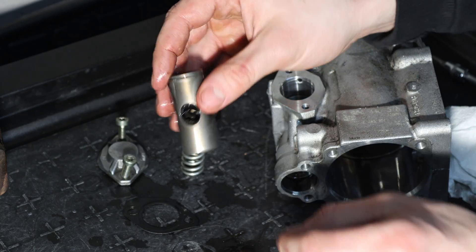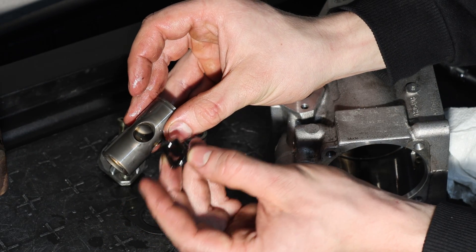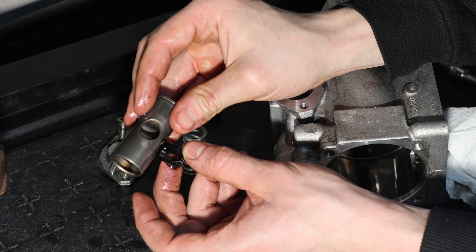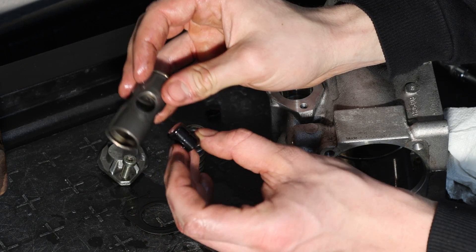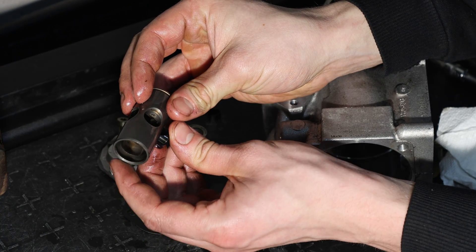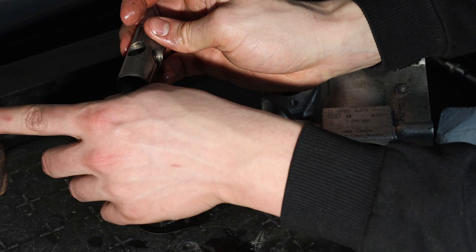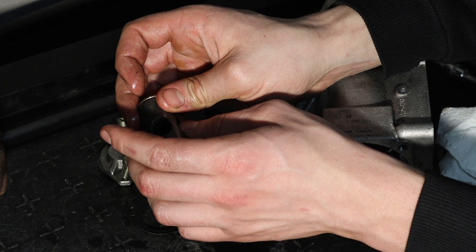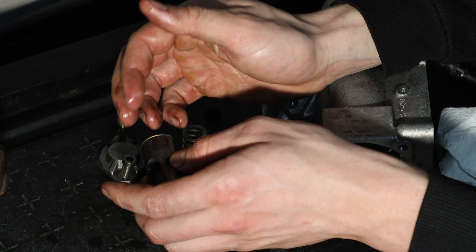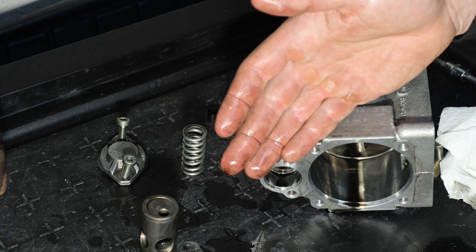This is the shim. It's a weird contraption because there is a pin that holds down a pin that holds down a pin for the main pin. I'm going to put everything back really cleaned. All the internals look pretty much new on this pump — this has probably been changed and is in amazing condition. The only thing that wasn't good is the main actuator on the pump hat wasn't able to function, because the car sat for three months plus and I think the diesel just gunked up the main shaft. This is now getting cleaned, dipped in oil, and reassembly time with new seals.